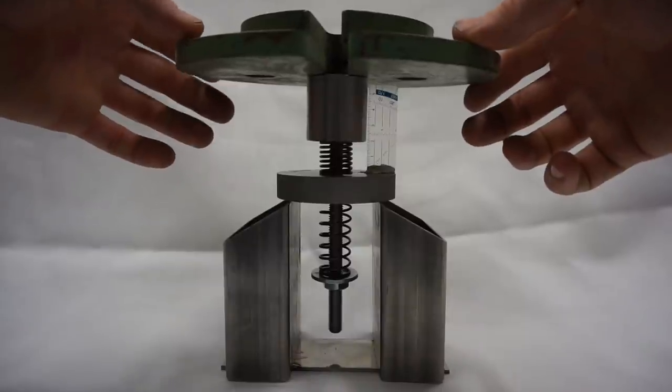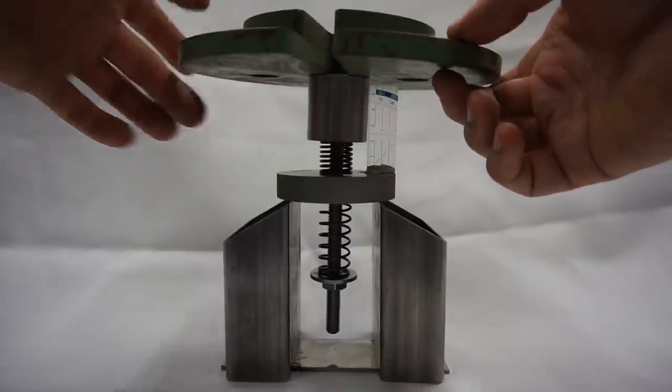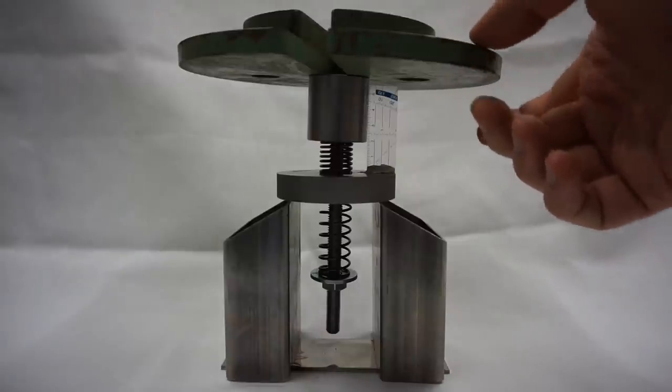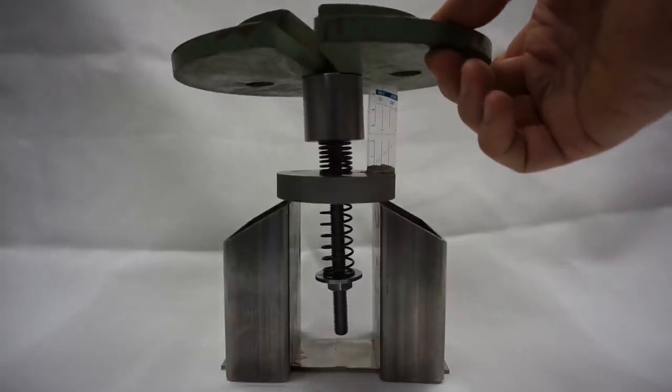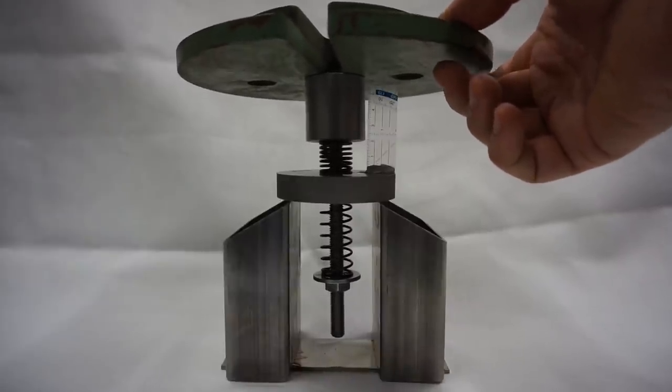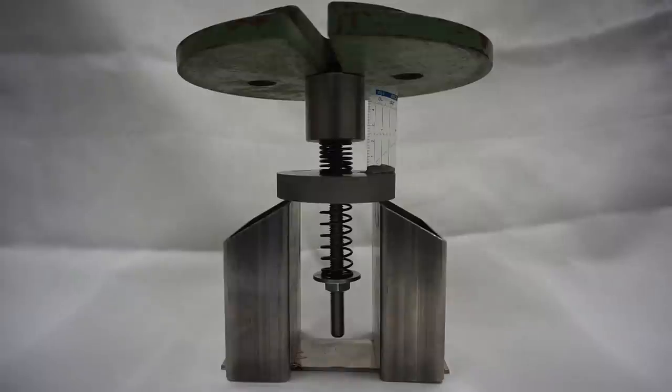And our new position, or our deflected chuck position, is at roughly, well, I would say 19 millimeters. Yeah, this is a very precise experiment. So with preload, the deflection is from 32 to 19 millimeters, which equals roughly 13 millimeters spindle deflection. You surely noted that this is only half of what we had in the unpreloaded case before.